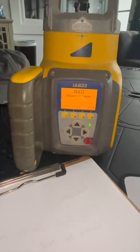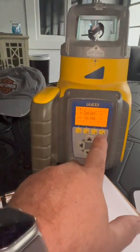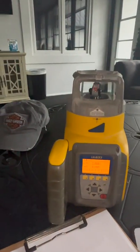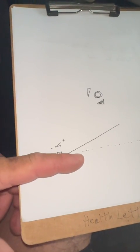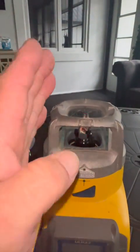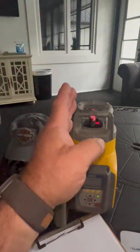Turn on the laser and we're just going to go through this a little bit. All lasers are basically the same — might look a little different in the menu, but here you've got the slope for Y and this is the slope for X. We go right in here to the slope and we can change Y if we want. Two percent is a great number for cutting in grass sod. These are the sights you sight with, so you're sighting in line. You've got to have your laser sighted — if you're 10 feet off a pipe and you're going to dig to another pipe, then you've got to sight 10 feet over, so you're parallel with the sightings to get perfect.